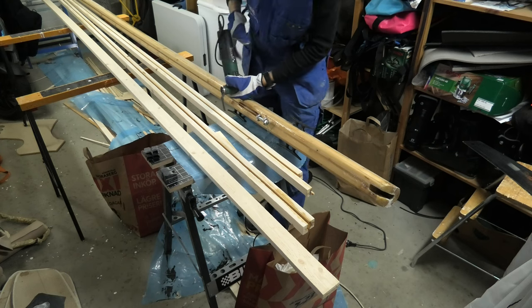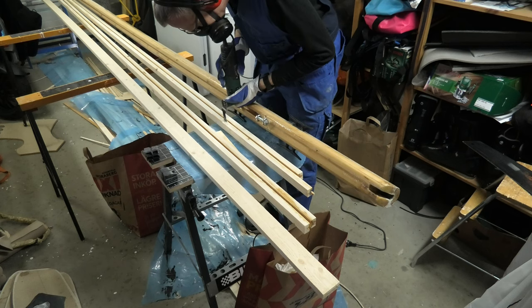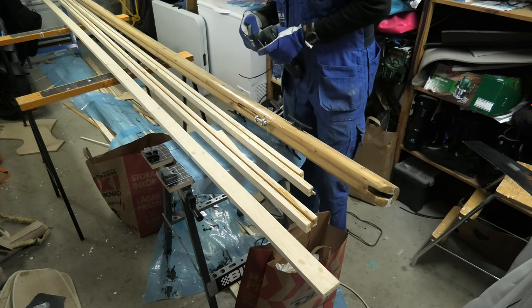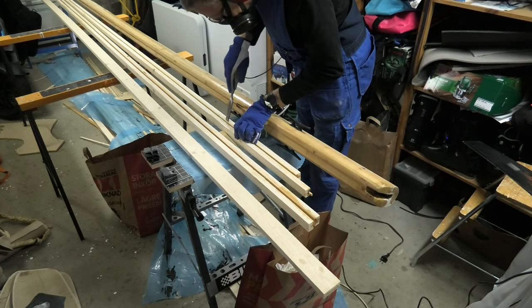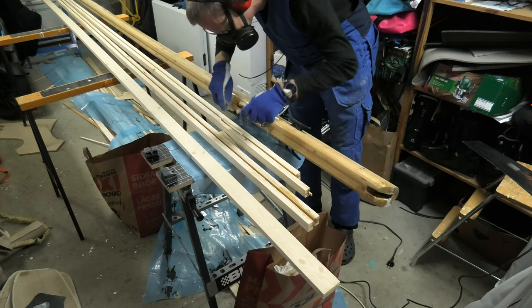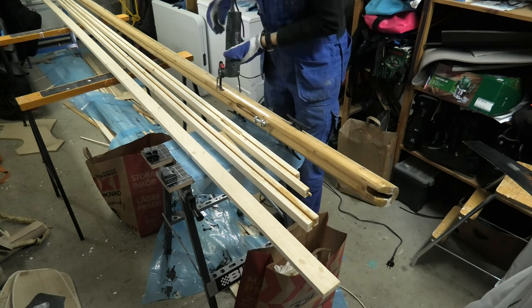A multi-tool is perfect for this type of cutting. I cut along the grove to make the exit hole wide enough to let out the sail, and change tool to cut the short upside of the exit hole. With the stop it is easier to get the correct depth. With the chisel I break off the last attachments.